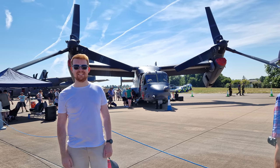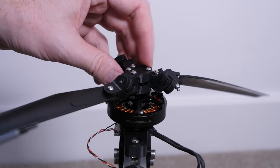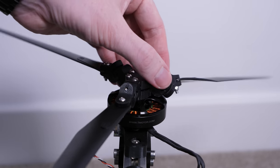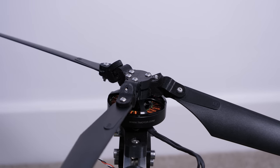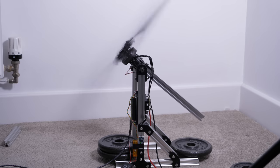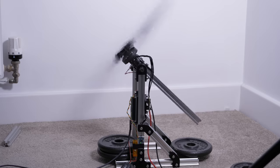The real Osprey has three blades on each rotor, not two. So I 3D printed a three-bladed rotor head with two blades using the same hinge angle and the remaining blade using the reversed hinge angle, which is the advantage of having a test rig, so I can trial these things without consequences. But surprisingly, the three-bladed rotor head works just as well.